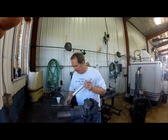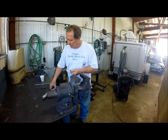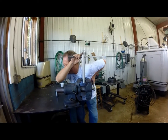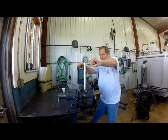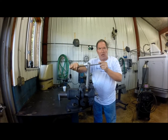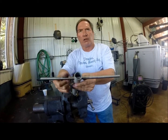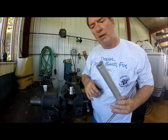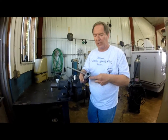Here's our test piece, and we're going to put this in here. We're going to clamp it this way — this is the end with the doubler that's not glued. Notice that the end where the doubler was not glued fractured. The doubler that is glued not only did not fracture, but it's not damaged even in the least. So there you have it — Skunk Works production in association with Stolper Aerospace and Aerodynamics. We've decided conclusively that gluing the doubler in makes sense.